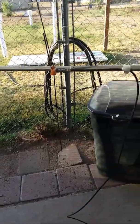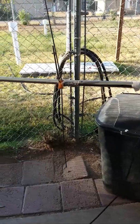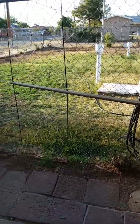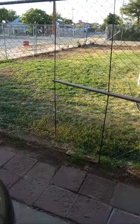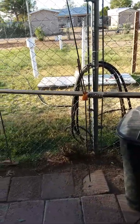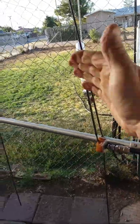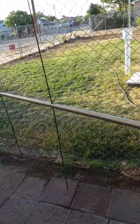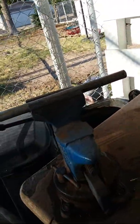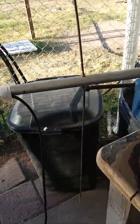So here's what I'm going to be doing. I'm working with Yagis today. I'm going to be making some changes with this Yagi so that I can make it from a vertically polarized antenna to a horizontally polarized. And in essence, all I'd have to do is just take the beam and turn it to where these elements are pointing horizontal. But then they wouldn't fit the bracket. The clamp goes around the mast and through these holes right here.